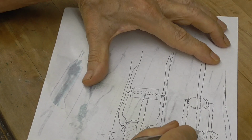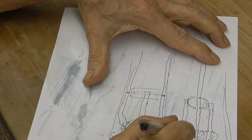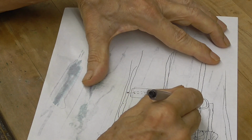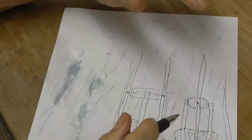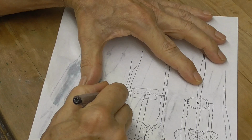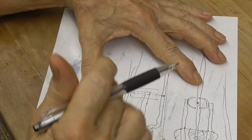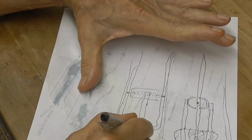And that'll be sealed into glass. So we'll have no contact between here and here. That'll be isolated by the glass. And then our filament will be right in the center of there, welded onto here. Okay? So that'll make it to where we have got the axial alignment, the longitudinal alignment, and the angular alignment, all of it referred to this one seal on the end.